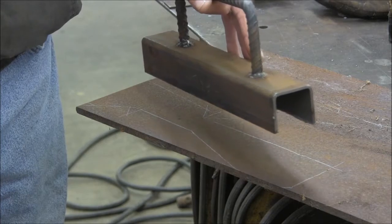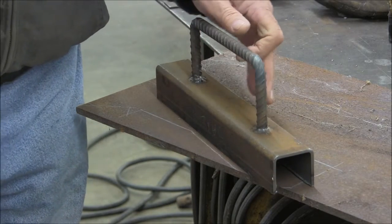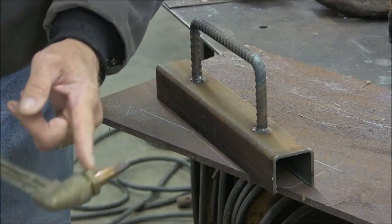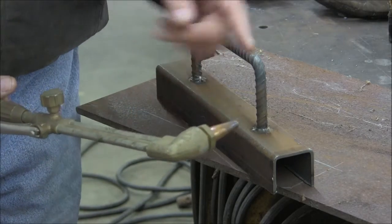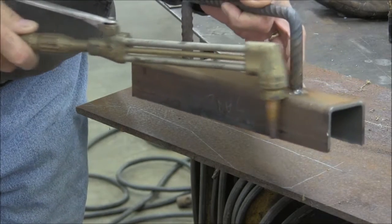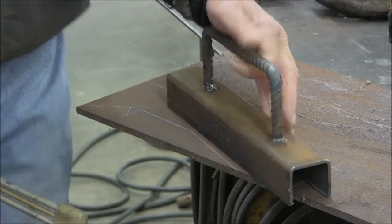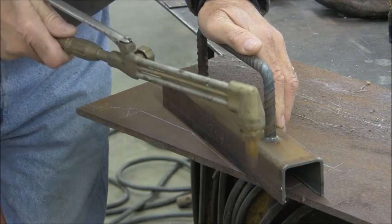First, you line it up parallel with your line, and with this tip, and since we're on the inside of the line, we'll use about 1/4 of an inch gap. Next, to control the height of the tip to the workpiece, you rest this nut on the top of the straight edge, like so. Here's what it looks like.